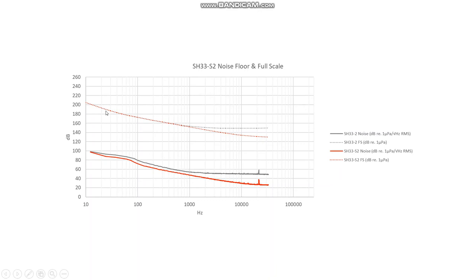Well, an excellent example of that is when you're monitoring both artificial noises, anthropogenic noises that may be quite strong, say pile driving, for example, or shipping noise. If you want to see how animals react to that, so at high frequencies, where you have your dolphins or porpoises maybe in some cases, there it becomes very, very sensitive, so you can pick up a faint signal. And then at the low frequencies, you can accept the strong artificial noise without clipping and therefore without data loss. So that is a slope configuration here.